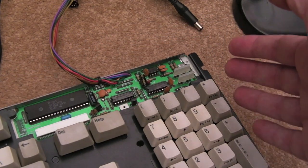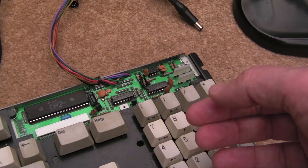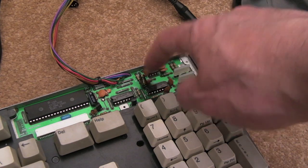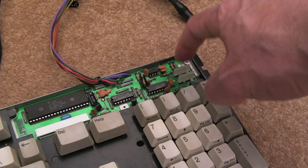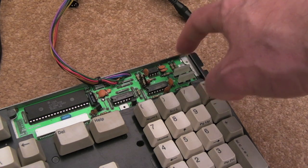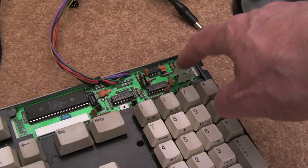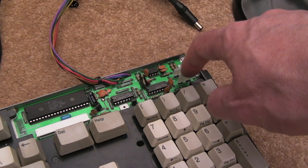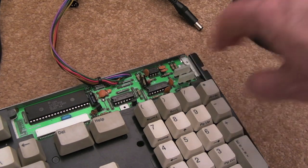At that point I could feed five volts — maybe through a resistor — to the power LED. The second LED isn't going to be used, but there are spaces on that keyboard for those two LEDs. You could find an alternative use for the floppy LED — in theory you could just use them both as power lights.